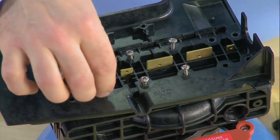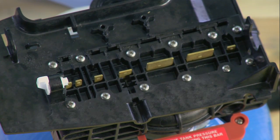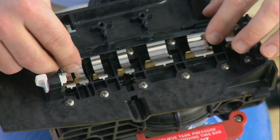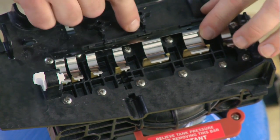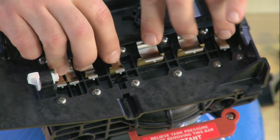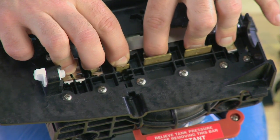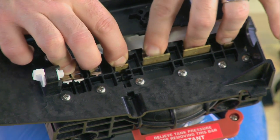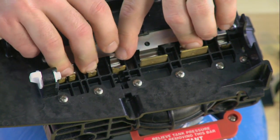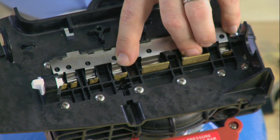Please reference your service manual to see the tensioning procedure. We can then reinstall our one piece spring assembly. The key to installation is making sure that each of the pieces is tucked under the ridge towards the rear. Once they are all tucked in, while pulling back, we can press down on the individual spring pieces. If necessary, you can use a straight tip screwdriver blade in order to make sure you align the spring with the individual valve discs.